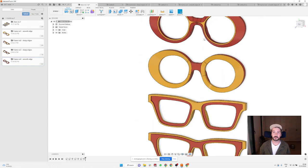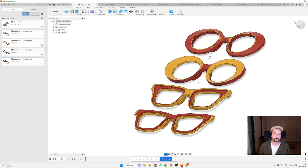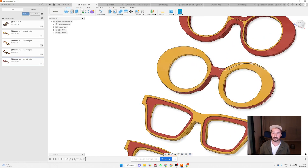With this kind of operation, when you do a lot of scalloping and you do the chamfered edges, you don't need to be worried that much, because it's gonna look good. And maybe you might have a little bit more area here and less here, but it's not gonna be visible after barreling.